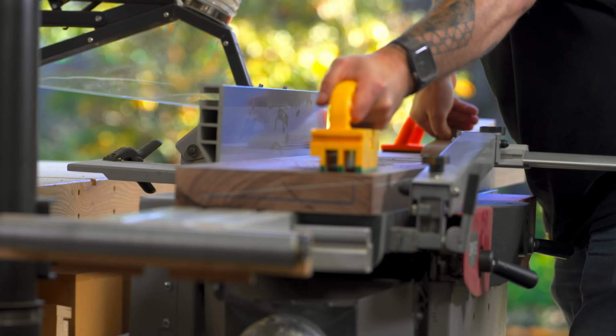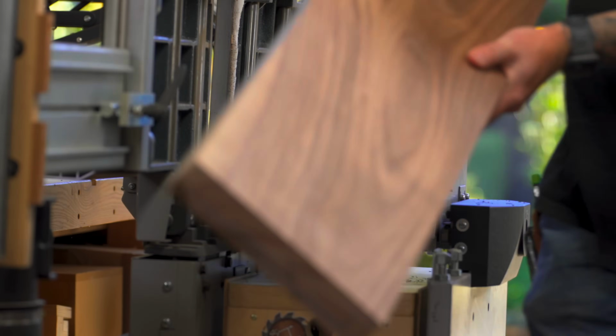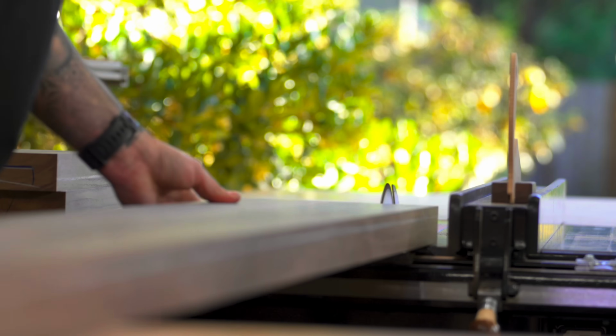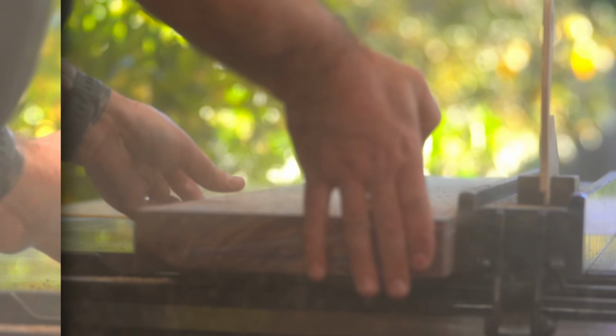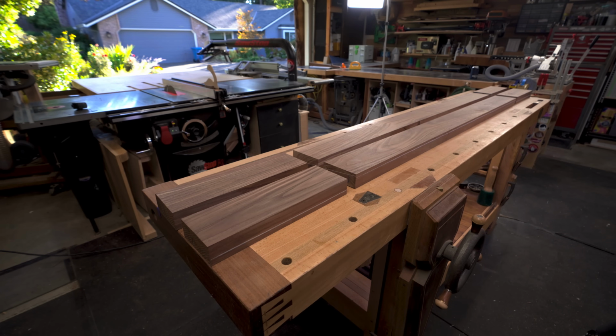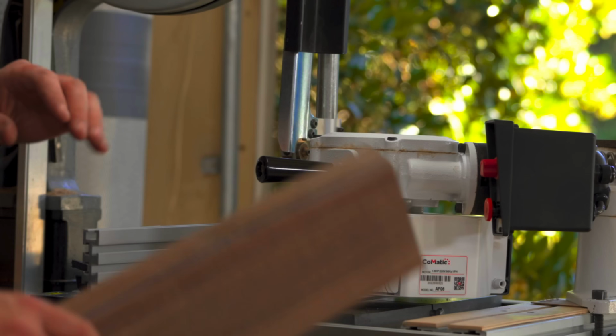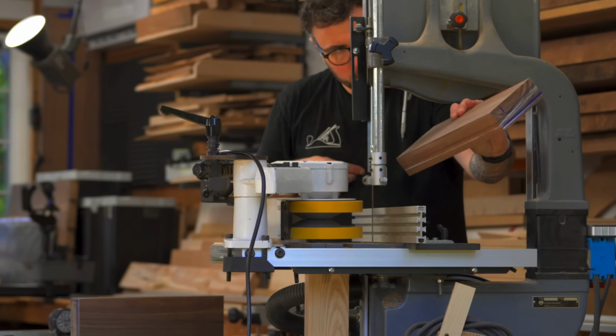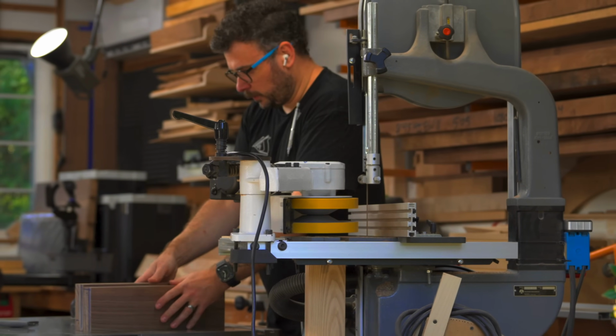In order to achieve the depth of this box, aka case or carcass, I'll be slicing the board open like a butterflied filet mignon. This will give really nice symmetry from the front to the back of the box. By ripping it in half first, I'll have much less for my bandsaw to cut through, which should result in a cleaner, flatter box. And everyone loves a well-maintained box.